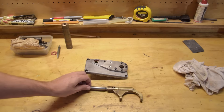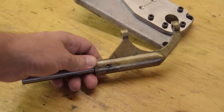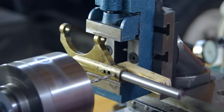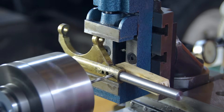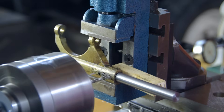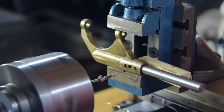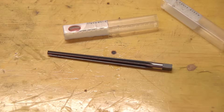You can see from the number of holes that I'm not the first hairy-armed man to work on this drill — there's one original taper pin hole plus two subsequent attempts, and I'm going to add a third. At first I drilled an 11/64 pilot hole for a number four taper pin — that's what the internet told me to use — but the internet was wrong. I ended up using a 13/64 drill bit, that's 13/64 of 25.4 millimeters for us metric guys, or as you North Americanos prefer, 0.203125 inches. Now it's time to form the taper.